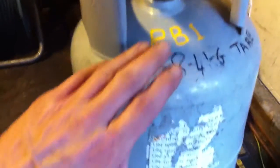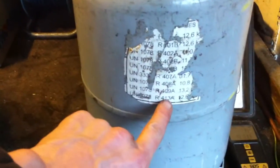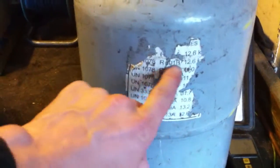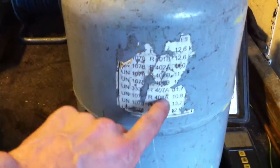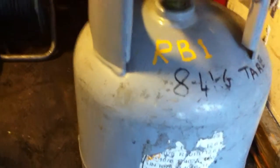And that is why you never fill a recovery cylinder with as much as you would a brand new cylinder. Something like this, we've got a chart on here. I think R22, you probably have maybe 12 kilos in there, some of them 13 kilos. But you would never put more than probably 10 kilos in this — and that allows for the fact that the bottom bit could be oil. And that's something to be aware of.